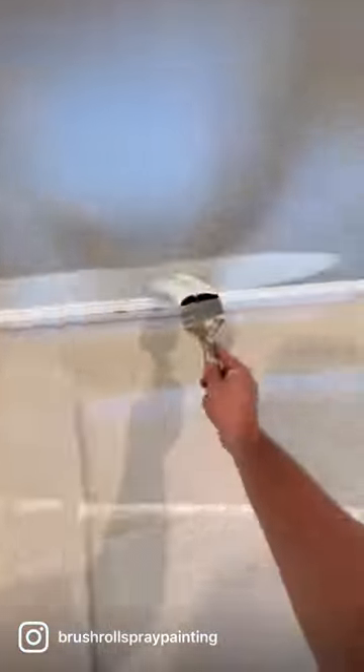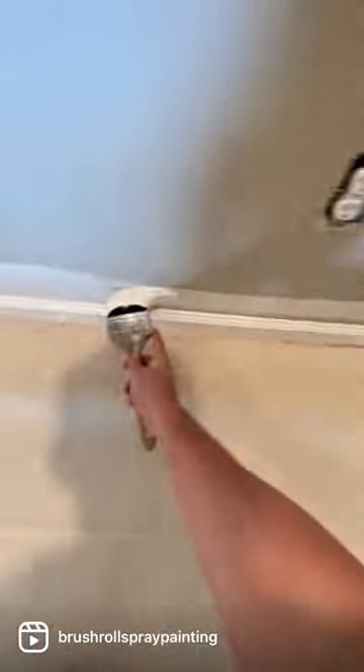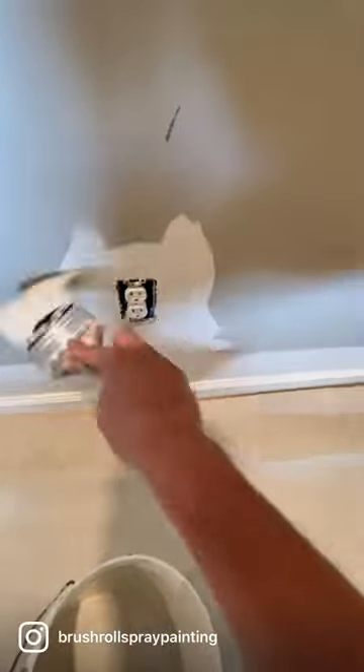Hey, hey, hey, all you filthy painters. There's a nice POV of me cutting out a wall. We are using a three-inch pretty peacock, and we are tagging the top of the baseboards. Why? Because we're going to come back later and we're going to fine line that with some trim paint.